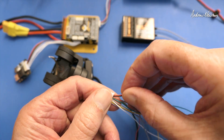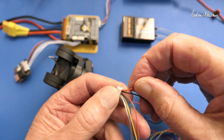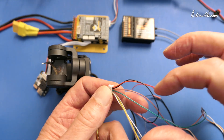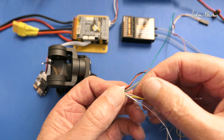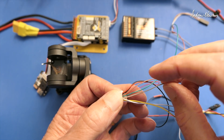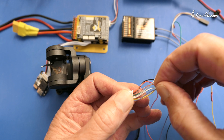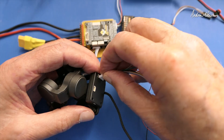Here's the power and connection cable. The first two pins are power to the gimbal — 7.4 to 26.4 volts. The next two are for UART connection, for connecting to a flight control board for head tracker and normal control, but I won't be doing that. The next four are the PWM cables. PWM-1 is for mode selection — you can also use that for serial receiver connections like SBUS and ExpressLRS. Next one is follow gain sensitivity. Then the yellow one is for pan and the blue one is for tilt.